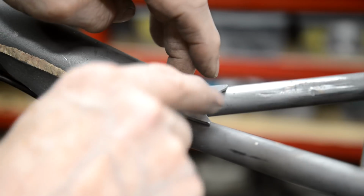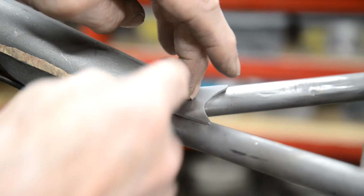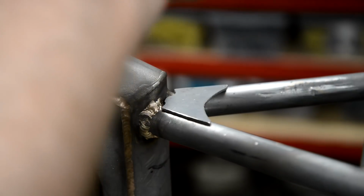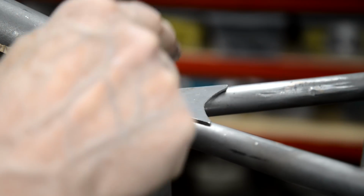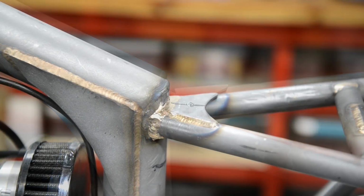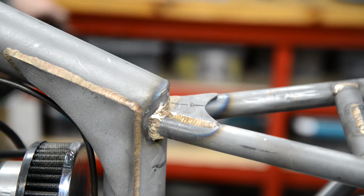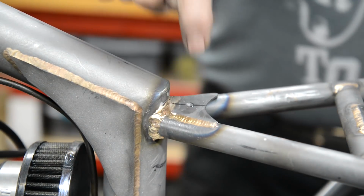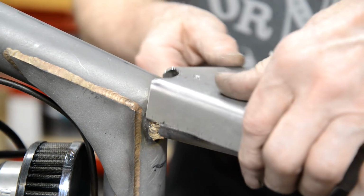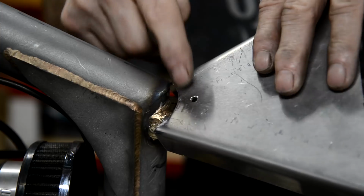So let me bronze that in, then we're going to drill it, and then from the bottom we'll mark the seat pan. Now drill the seat pan, we drill 1/4 inch in the seat pan, we're going to drill, I think it's 7/16 here for the grommet. Now I want to get these holes for the mounting pin exactly the same. So what I've done is I drilled a little pilot hole, 1/8 of an inch, something like that. Put that on, marked it from underneath, drilled that.